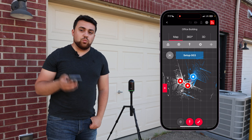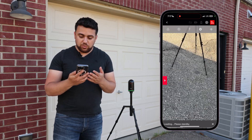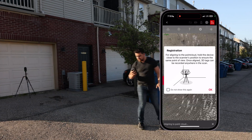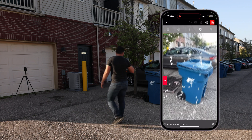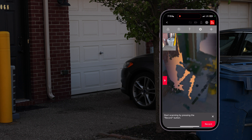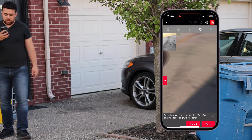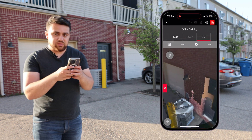Select the scan where this took place — this was setup three. Select the annotate option, come to where it says 3D, and select capture. It will load and initialize the app, then ask you to stand where the scanner was during that third setup. I know the scanner was somewhere in this vicinity, so I'll show the area here and it will align me with the existing point cloud. Once it finds our position, I'll get closer to the AC unit and select record. The iPhone's LiDAR sensor fills in the missing gaps as I go around the AC unit. When I'm satisfied, I'll hit save. Zooming into the air conditioning unit, I can see a more filled-in scan thanks to the iPhone's LiDAR sensor.